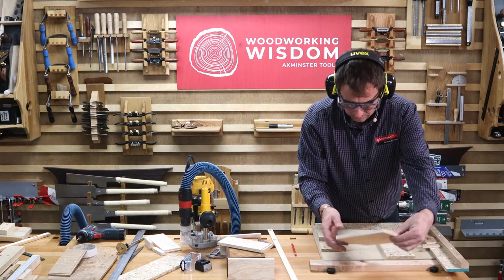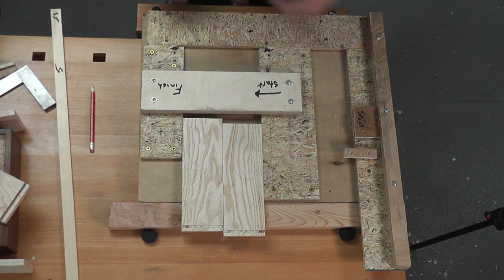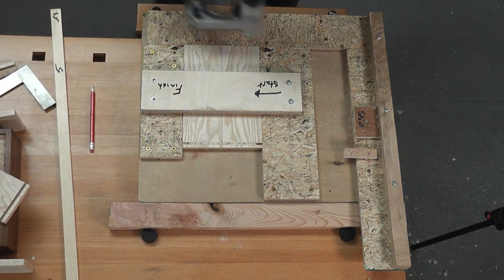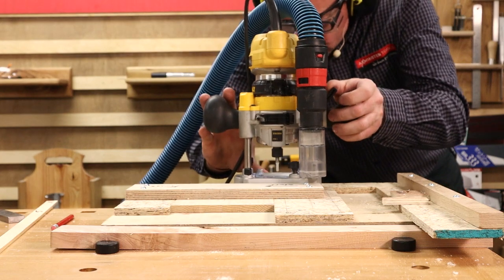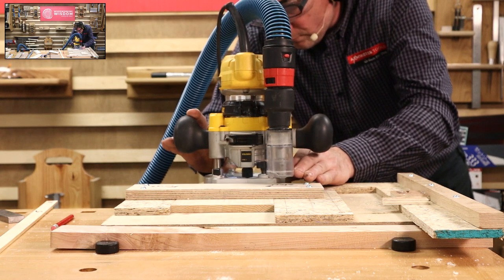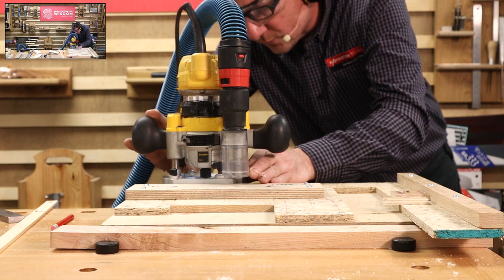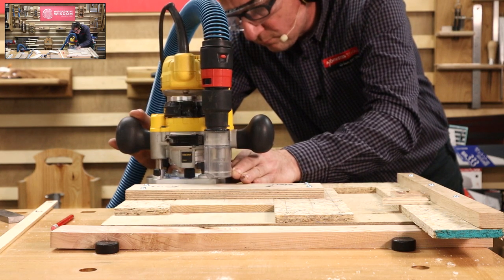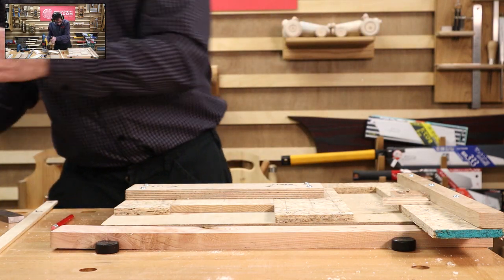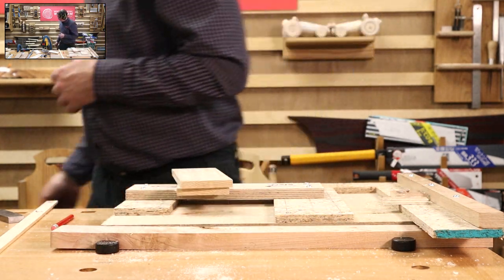Got to turn them around. In position. Clear the dust out. Check they come up to the front again. Going to do exactly the same. So, on, down, lock it off. Not too far, give the cutter time to remove the work. Slowly out the forward because not as much material there now supporting the fibres. Push those out. So let's turn the air off.